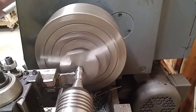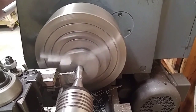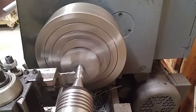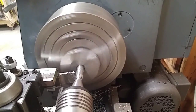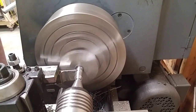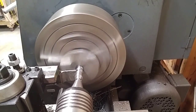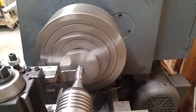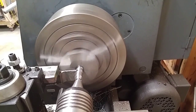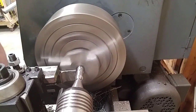Diameter set, I get the cam lobe width set, and what I need to do now is move down the one length of the cam itself, which is going to be 1 inch, 140 thousandths. So I'm going to go ahead and do that. As it turns out, I had it sticking out just enough to get the length I need on that thing. As you can see, I'm pretty much right up against the chuck. But that's fine. I'm gonna go ahead and get the rest of that material turned off there. I'll break a couple edges and I'm gonna part this off.